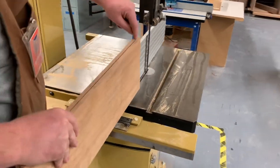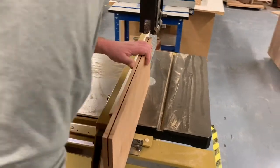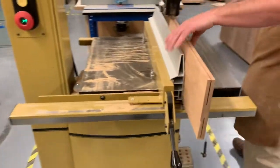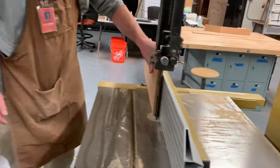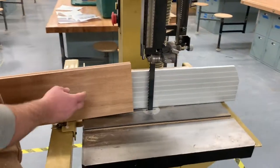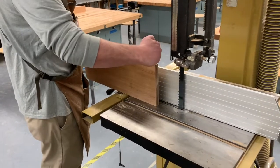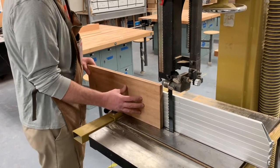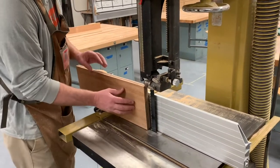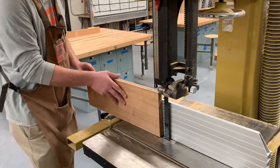Get the fence lined up so your board will line up with the blade right where you have your cut mark. Adjust that fence so the blade will be right in the center as you make this cut. When you make this cut it's important that you have good tight pressure against the fence — if the board starts to wander, your blade can start cutting the thick part. Keep a lot of pressure and watch your hand placement; never put your hand where the blade is.